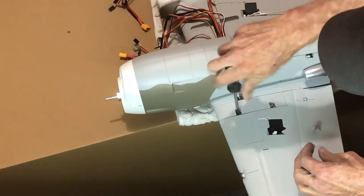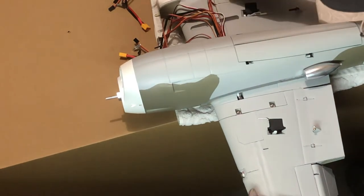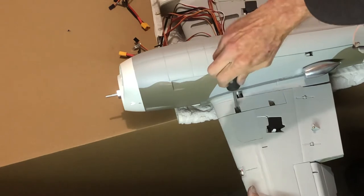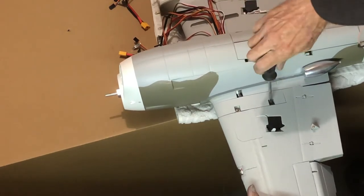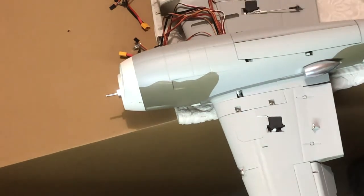This one will go right in. Pressure on it. Don't put no real wrenching on this, pilots, because these things are designed to be taken off and on, off and on, off and on. But if you sit there and wrench that thing and plan on taking it on and off, that little brass insert in there won't last long. Oh, Lord. The next step.